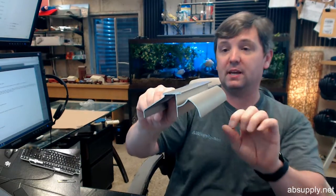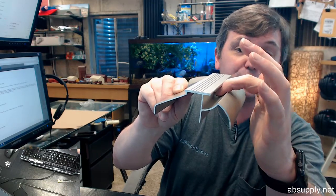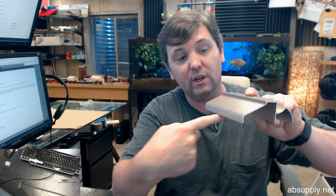Now, water return, what does that mean? If this was the genuine article, it ought to have, meaning it should have, weep holes, if you don't tell us to not ship it without them. Weep holes are just very small holes. There might be 3 in a 3-foot threshold that are drilled down in here. So any water that actually got inside of the door, to the inside face of where the door is, would run here. A weep hole system has a very small filing that's been done to the face of the threshold, so that water can enter here, exit out, and out towards the front of the threshold.